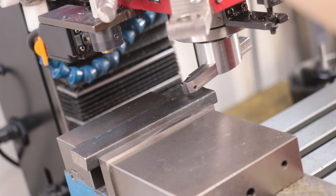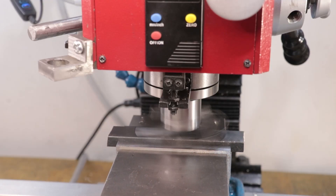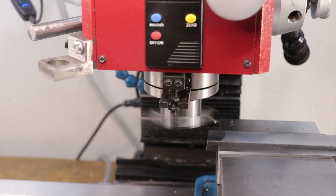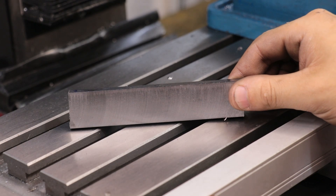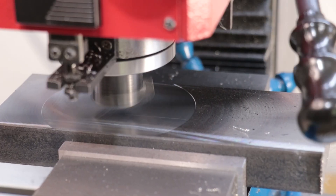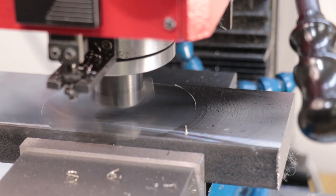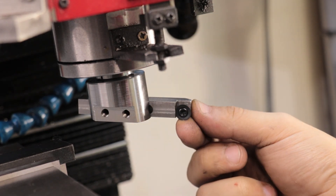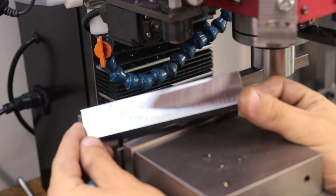The real test though is how does it perform. The fly cutter was cutting really nicely, which is something that you'd expect with this sort of insert. But I'd call that surface finish okay for a fly cutter — actually I was a bit disappointed. These clearly aren't finishing inserts but I was expecting a bit more from them. It's a bit surprising because the DCGT inserts that I used to use always gave me a much better finish. What I did was I screwed in a button insert and I ran that and I got a spectacular mirror finish on the first pass. So it's obvious that the problem was with these inserts.